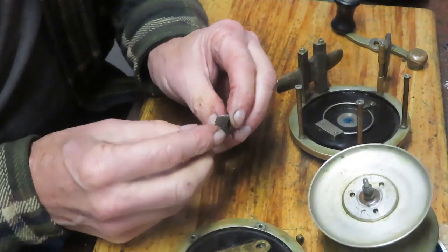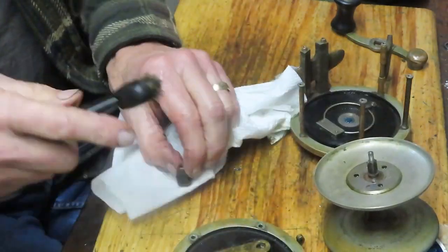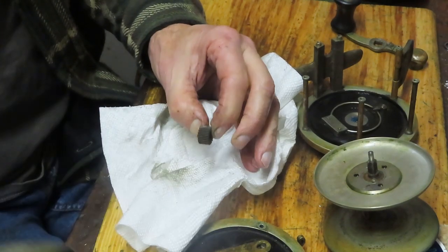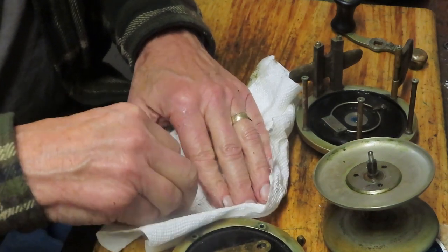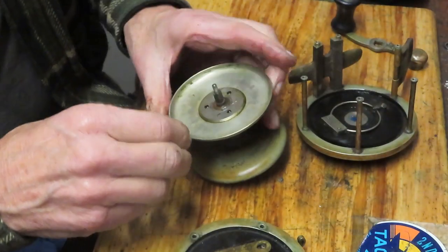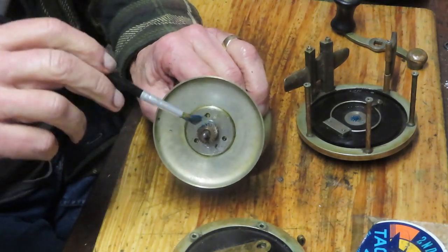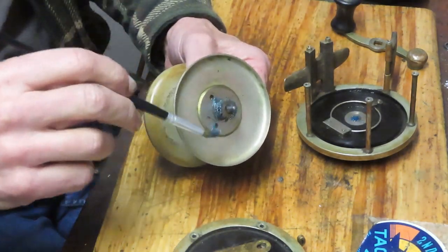We're going to see. I'm checking the teeth on the gear — they're all good. I'm going to use a hard brush and just kind of pull through it. This is like that little ball in the shell game — you've got to follow the bouncing ball. That's just going to simply sit over the post just like that. I'm going to grab a brush, put a nice amount of grease on that, and then we'll go over and clean up the other side.